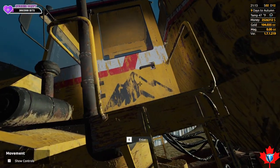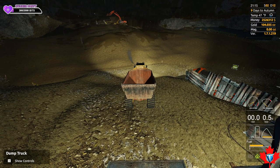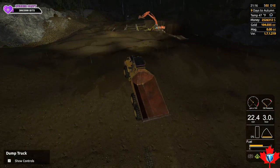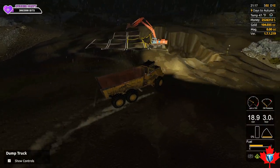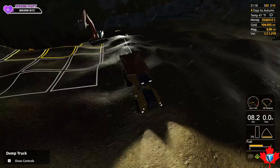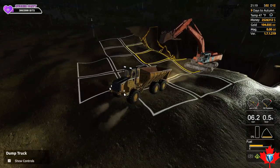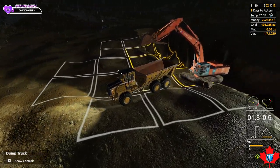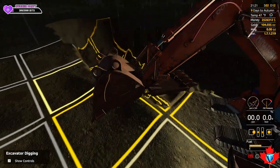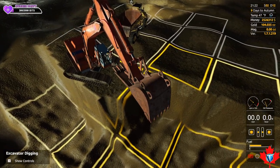Right. But yeah, you just do the half moons, almost like if you're at the beach and you have a sand wall in front of you and you take your hand, you kind of scoop a little bit, and you keep digging back further and further until you have a tunnel. That's basically what you're going to do with the dozers, is take the edge of the blade and scoop away a little bit more and then just keep going. Works a little bit better than just bashing the blade straight in. Bashing the blade straight in, you're going to end up hitting a wall. And the bigger your half moons or your C's are, your scoops, the easier it's going to be because you'll have more space to dump off the overburden.